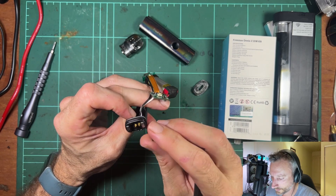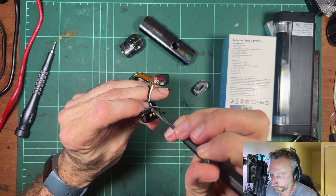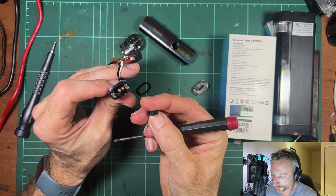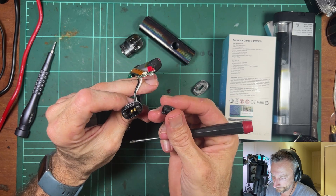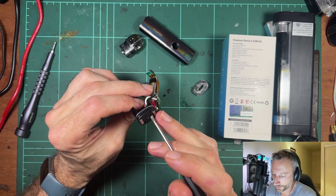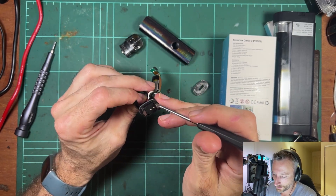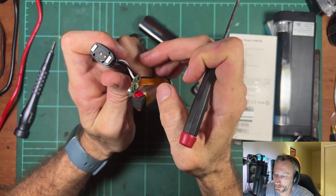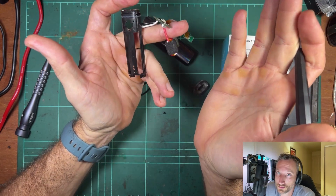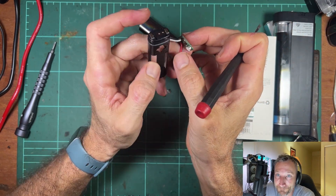Oh wait — I kind of stand corrected. It looks like there might be a recessed section to catch spills before it goes down the pins, but no — it won't work that way because it's all filled up with that silicone or rubber. So the liquid is working its way around that rubber and going through the passageway into the board. Yeah, pretty short verdict on this one: I can't really recommend it — annoyingly, because it performs great, I love the coils, it looks good, and the battery is correctly rated.